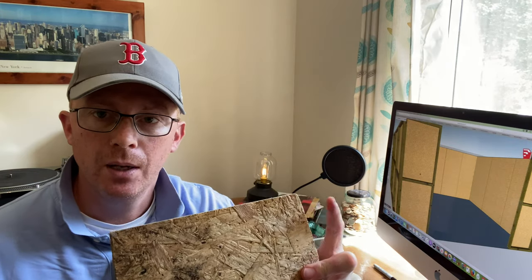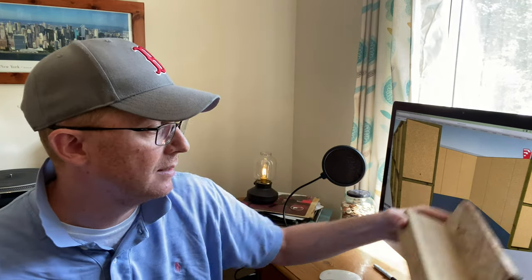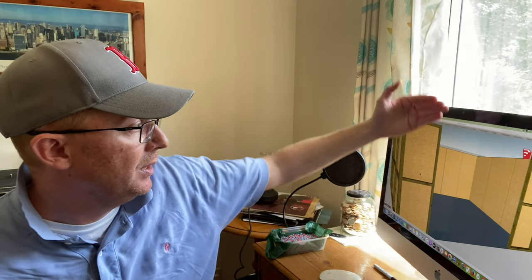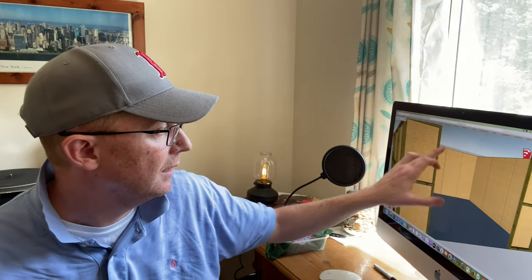Now I will be able to add some aluminium tape between the OSB boards on the inside of the frame. If you can see it on these lines here. And then I can put a piece of hardwood over the top of that, which might give it a bit of a feature for the inside. So I can line that with aluminium tape, but I can't line the inside of the Kingspan insulation with tape because obviously it's already all secured to each other. Now, will that create a problem?